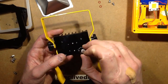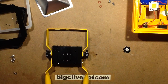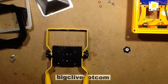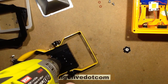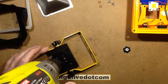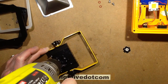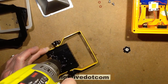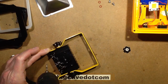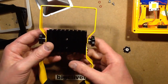I'm putting two new holes in because they don't really match the position of the holes for holding the star. I've already drilled one of them and I'm about to drill another and tap it. I'm using a generic eBay combined drill and tap. So let's do this one now — I'm just going to drill down, then tap it slowly. So that's it now drilled and tapped.